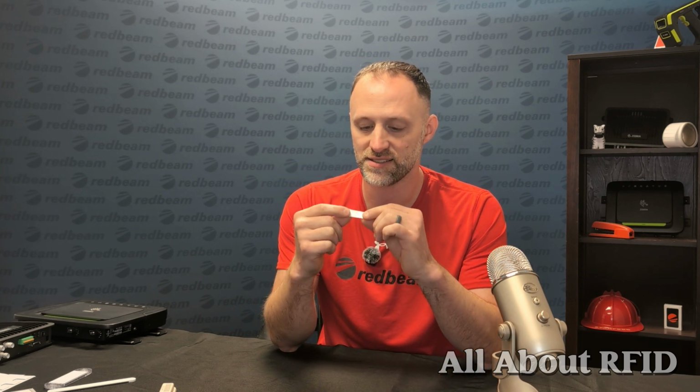Now we're going to take it one step further, and all of the tags are susceptible to the different material that they are on. And RF really hates metal and water. Simply stated, doesn't get along. The UHF frequency around 900 megahertz will reflect off of metal. It'll just bounce off of it. Because of that, if you take this paper tag and you put it on a metal machine, this antenna is going to be touching that machine. Now all of a sudden that whole machine is an antenna. So that little tiny chip and this little tiny antenna are never going to absorb enough of that RFID energy to actually turn on this chip, and you might as well not be tracking it at all. It becomes a completely useless project at that point.